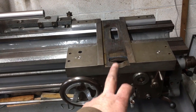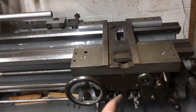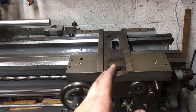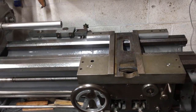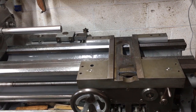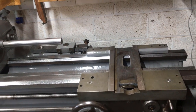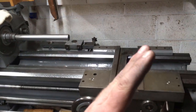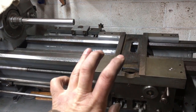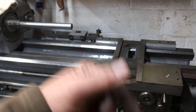The two cross slides - the blank which needed gear cutting and the original with the very worn thread - are on their way back to me now, the blank having been gear cut. I'll put a link in the next video showing the process, because it's quite impressive. It's all numerically controlled with encoders that split a revolution into three thousand six hundred, seven thousand two hundred, and various other divisions, giving very accurate rotational count. That's linked through to a drive turning the rotary head, which indexes the workpiece as it's being hobbed. Fascinating - I used to work with someone who did that sort of thing.